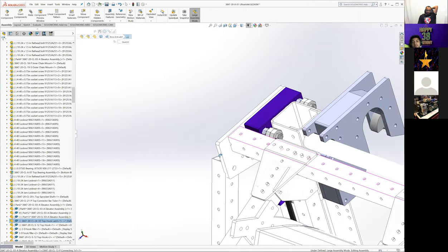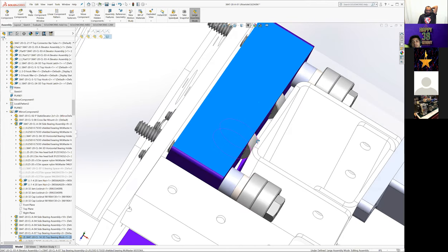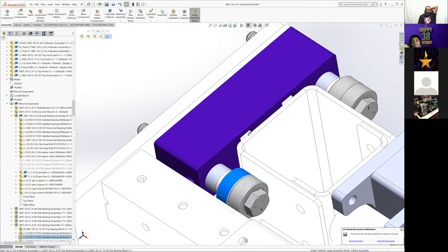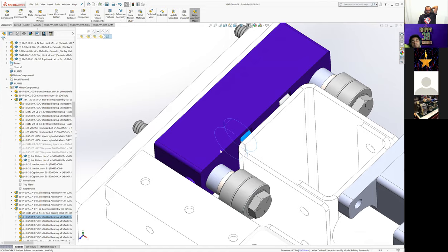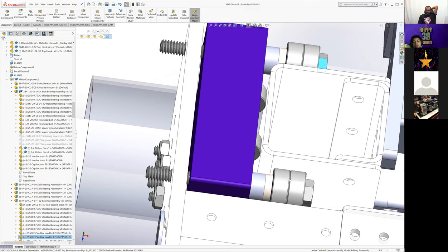One of the weirdest parts, oh, before we get to there, this assembly is interesting. Jack, you came up with parts of this, right? Or we ended up doing parts of this with the dowel going over here? Oh, yeah. So this is a place where it differs on 148. 148 didn't have their top bearings nearly as tall as we did, because we were trying to make sure we could get as much support up there and as much gap between our bearings as we could when we were fully extended. So you had to bring these up to the top. To do that, you can't just put a bolt going through here to hold these internal bearings in. So the way this actually works is there's a quarter inch dowel that gets pressed in, that goes through both of these bearings, and then the bolts to hold these outer bearings on, these quarter 20 bolts, stop that dowel from being able to slide around on the inside. So that makes this bearing block super compact and gets these bearings a little closer to the top of our assembly.